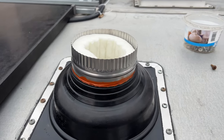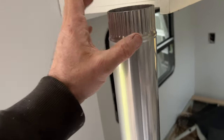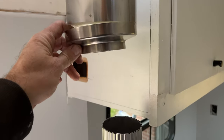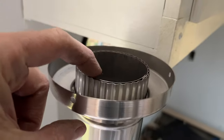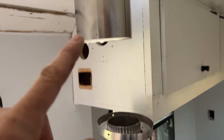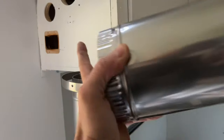The stove is roughly in the right place with the pipe going through the roof. I want this installation fixed — I don't want to be removing caps. I'll put the trim ring on the bottom to make it look nice. The pipe has an inner and outer section — the inside one goes inside the stove, the outside goes around the collar. Then I'll run the pipe down from the top, with another insulated section at the bottom to keep it protected away from my cupboards.